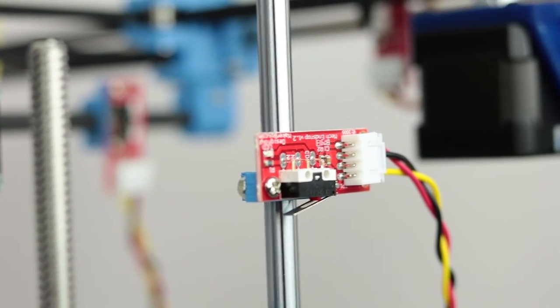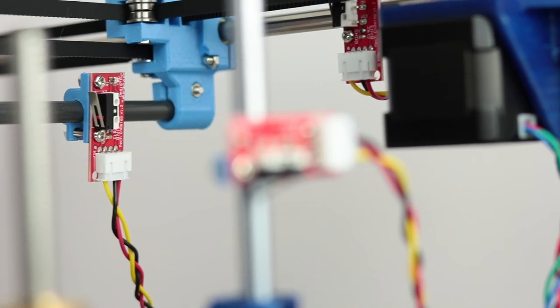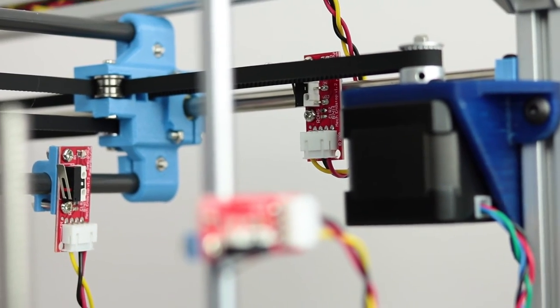So I'm sticking with three micro switches, one for each axis. The Z axis will have a screw adjustment, and the X and Y will just be placed approximately where they need to go. The end stops will clamp onto the shafts and just sit and stay. Easy.